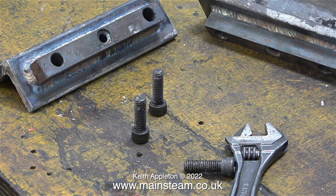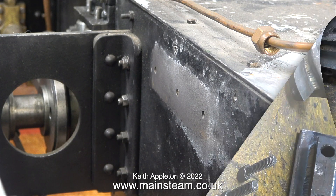In this clip you can see some M6 cap head bolts in the shot. I thought about using these in place of the 2BA bolts but then I looked at the job in detail. Enlarging the existing holes in the frames would be difficult because of other components outboard of the frames — for instance the screw reverser and on the other side the hand pump.